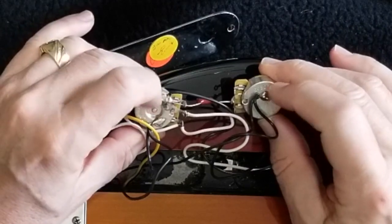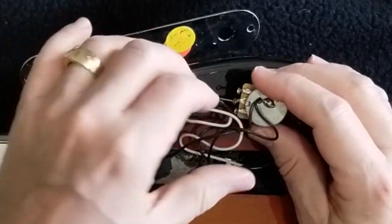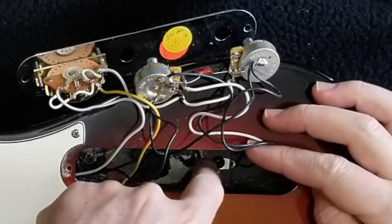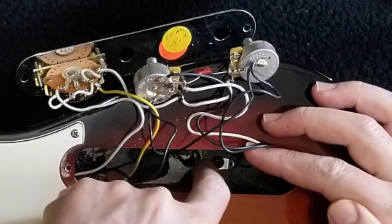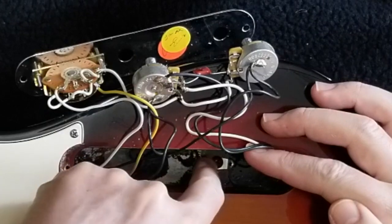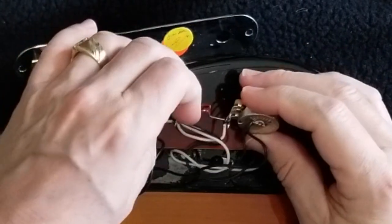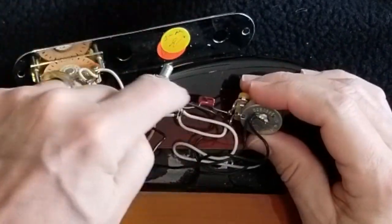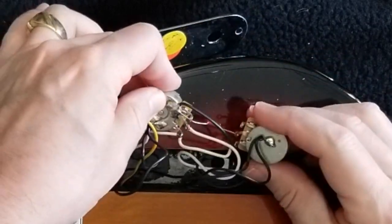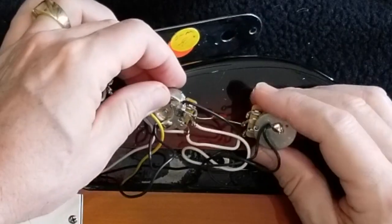The casing is considered ground. Look at all the black wires — all of them lead to ground. One of them specifically goes right down here to a screw that's in the guitar body. All electric guitars that I've encountered have this screw into the body, and at least one of the ground wires connects to that. This is the capacitor that connects the volume and the tone together. Notice how it also has a lead to the casing which leads to ground.